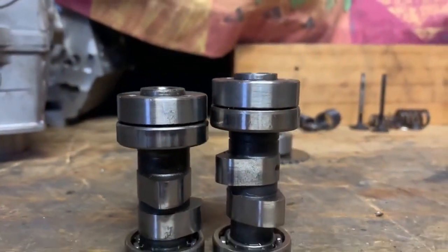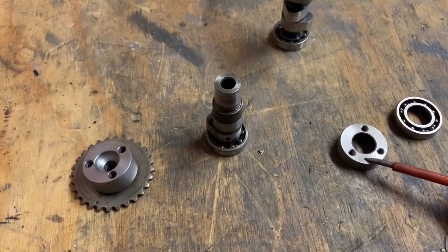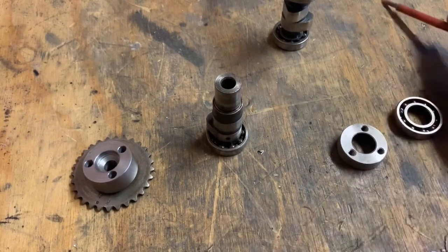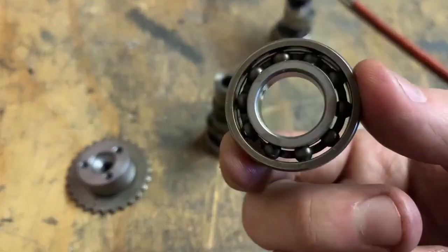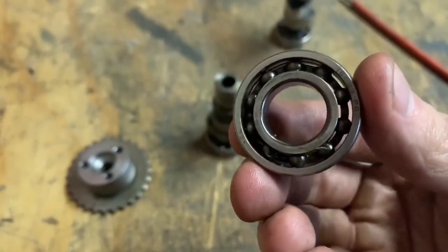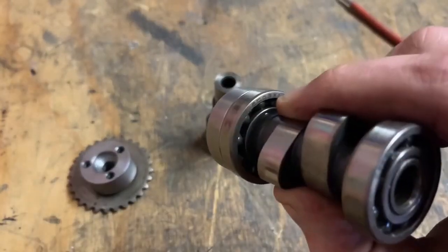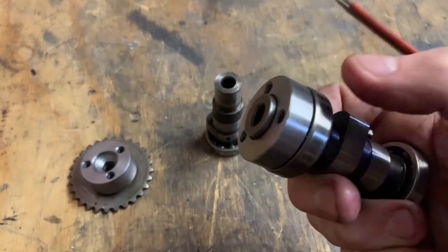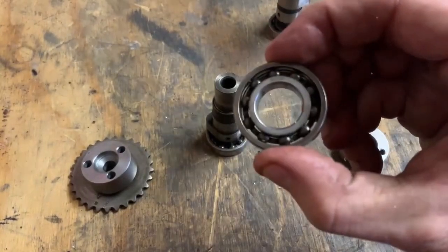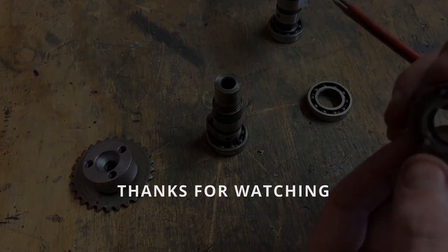At this point I noticed both my good and bad camshaft weren't interchangeable, so I pressed the cam sprocket mount off of the camshaft. Easy enough to get to this bearing — it is allegedly P6, a 6003. It is the exact same as the bearing on the other camshaft, the longer one. So worst case scenario, this bearing is in really good condition and I just pinch this bearing. Otherwise I'll press one of these up and see how that goes. And that's all for this week, thanks for watching.